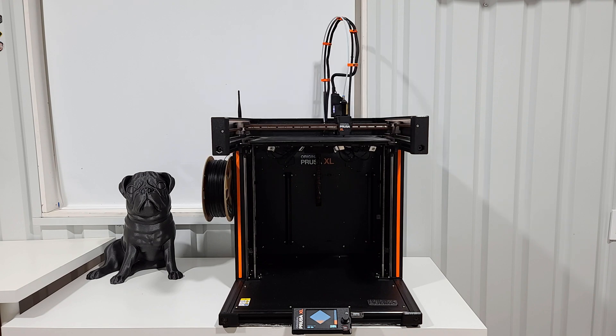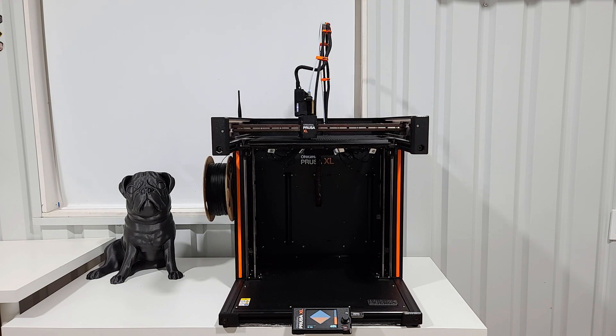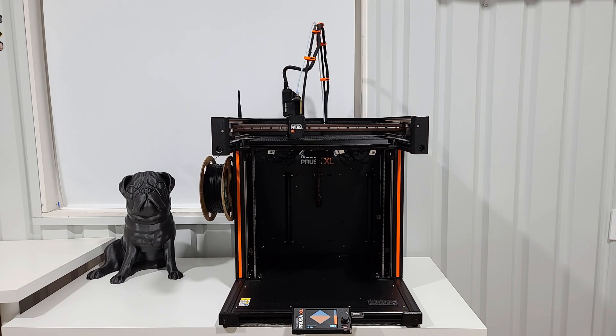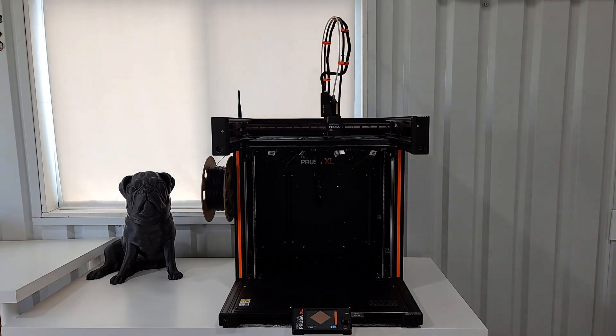The design is 14 inches by 14 inches and half an inch thick. I chose to print it in PLA because this is just something he'll set down when the drone takes off and lands. I used the 0.4 layer height with 20% infill and a 0.6 nozzle. It came out as a 13 hour print.